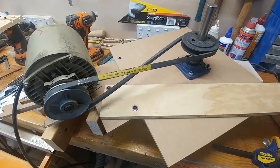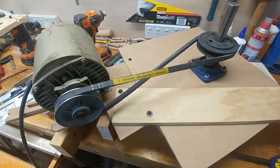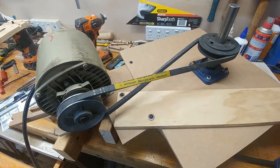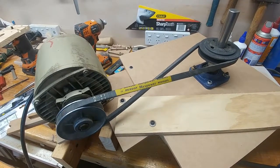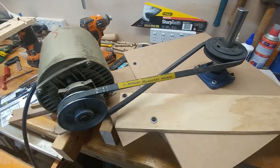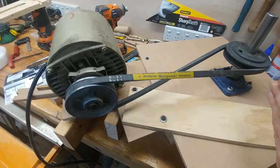The classic problem with this is you want to make sure that the force that acts to tension the belt doesn't have to push on the line of the belt. If it does, then it's very easy for it to slip straight in that way. So you kind of need something that wedges in from the side or turns it around.